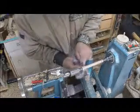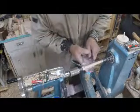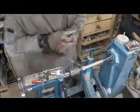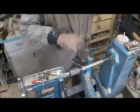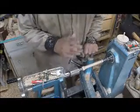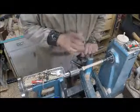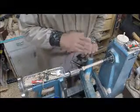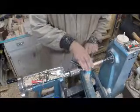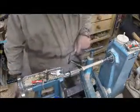When I've been making these yarn caddies, I've been using a product called Osmo. I like the satin finish or the clear. So Osmo top oil, it's a hard wax oil. It fills really nicely. You put it on, let it set for an hour, put a second coat on, wipe off the excess, and then let it cure for 24 hours. And then when you come back out, you put it on a Beall buffing system, and it gives you a real nice, soft, warm feel.